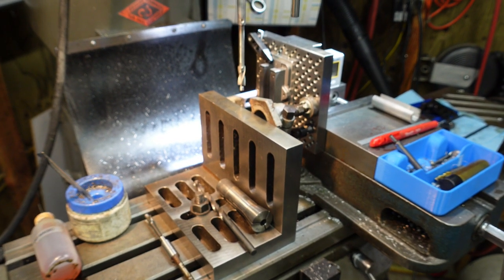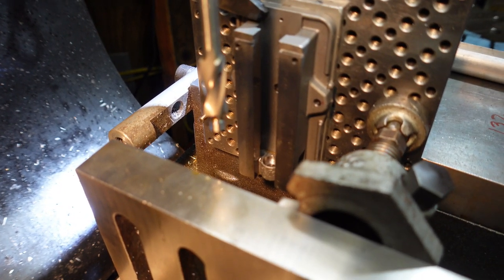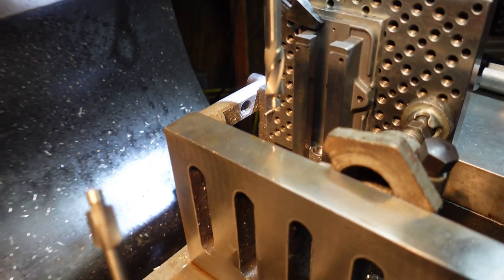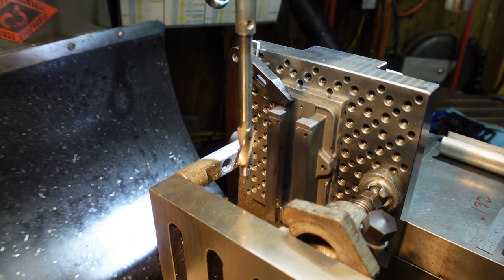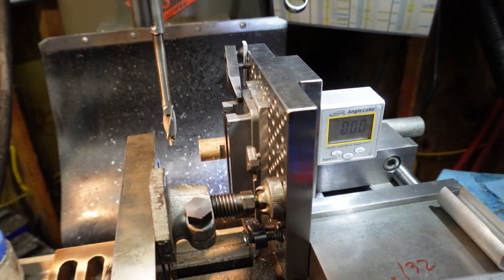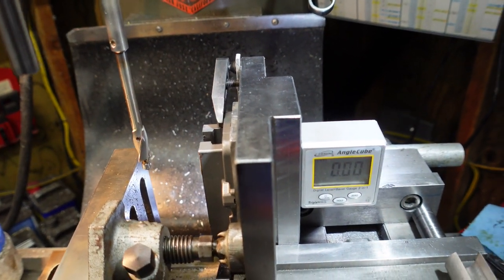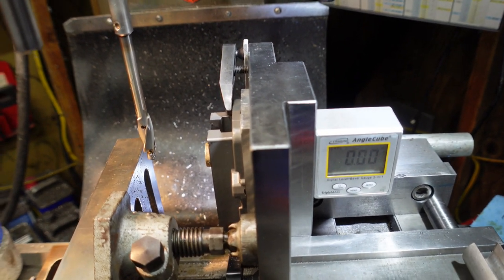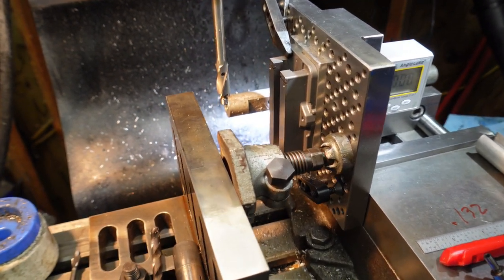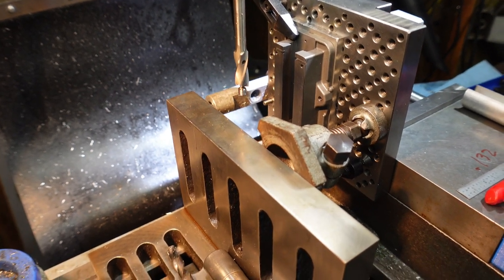This is the setup for the counterbore. Looking down in there, it's a 200 thousandths deep counterbore by 400 thousandths wide. Luckily I had the actual tool to do it — actually I had a second tool to do it. You can see I've got a jack, an angle plate, and the angle cube, and it was a pretty simple setup. Since this pallet has the piece underneath holding it in the horizontal, all I had to do is set it up vertical and I'm still on center. Then I just came over with an edge finder, find the edge, and I know my depth for all my work. That's how I ended up getting the counterbore. Got the counterbore — I made this one first; it was a quickie.